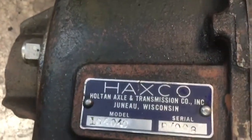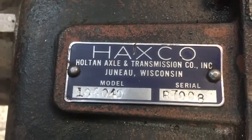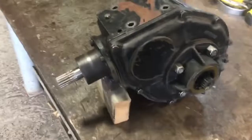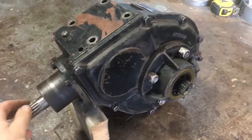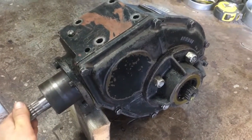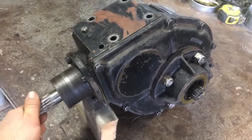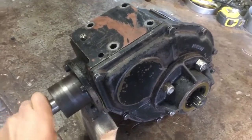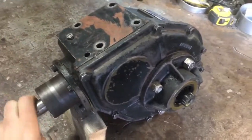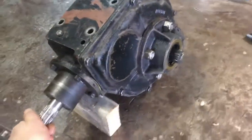This is the DIFF model 104-040. Serial number is R7008. Everything on the Hefty is like discrete modules joined by a drive shaft, so if this one's bad in the worst case scenario, I can pillage from my parts machine. But if ever they were both to fail, these parts are no longer available — though I can find some other differential and adapt the frame to fit it. So I feel like things are replaceable on the Hefty.